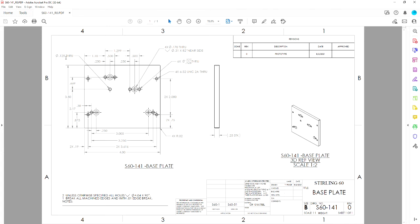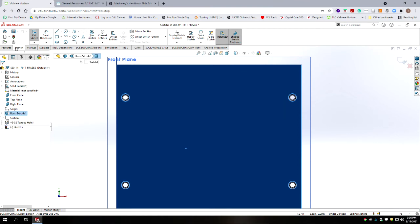So because we have plus or minus 5 tolerance on that hole, whereas the pattern of 6 is a much tighter tolerance, it has to be reamed. Okay, so here we go. We're going to make our 6 locations, and on our model we're going to flip back to this drawing to get our dimensions. So we're going to go sketch, we're going to make some points.